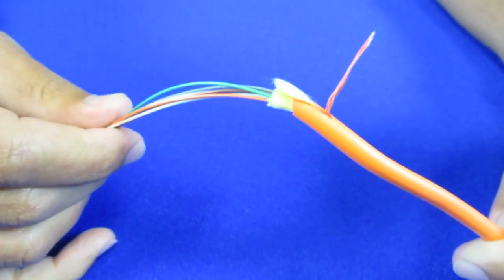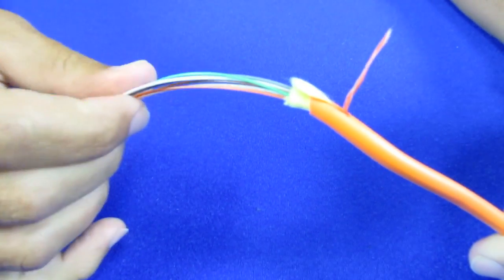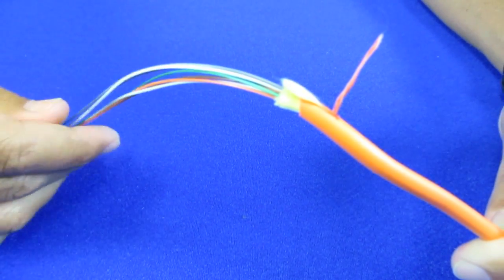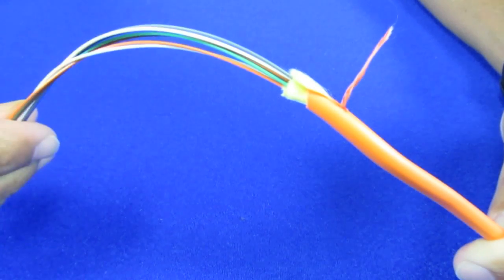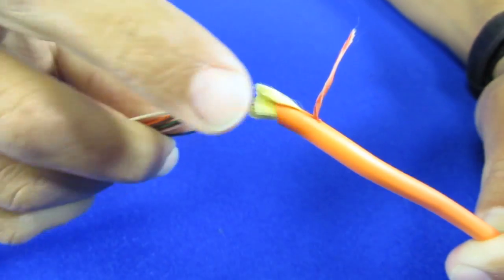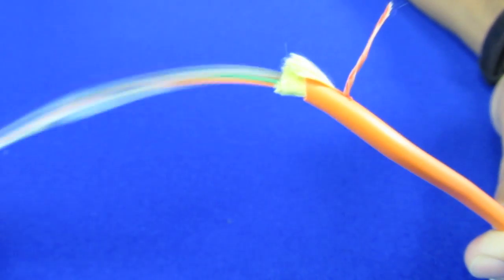The Trango licensed microwave products are compatible with any type of fiber optic cable, from single mode to the two types of multi-mode. In this case, we're using a 50 micron OM2 type indoor-outdoor fiber optic cable.